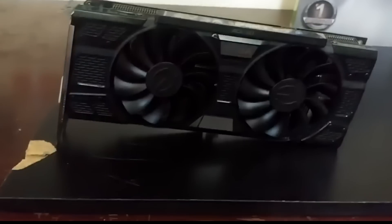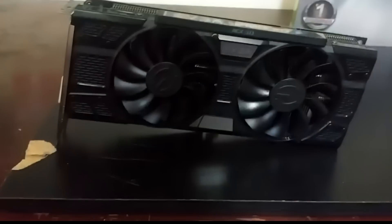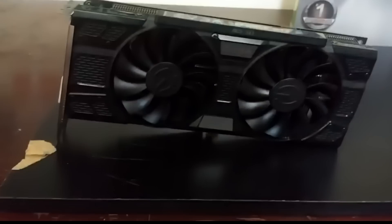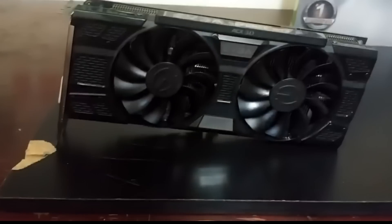Pascal has arrived to the entry-level market. The GTX 1050 For The Win has two gigabytes of video RAM — GDDR5. The specs overall: it's got 640 pixel pipelines, the base clock is 1442 MHz, the boost clock is 1556 MHz, and it's got 57.68 giga-texels per second texture fill rate.